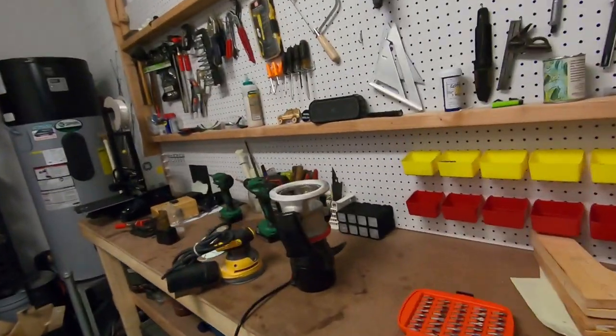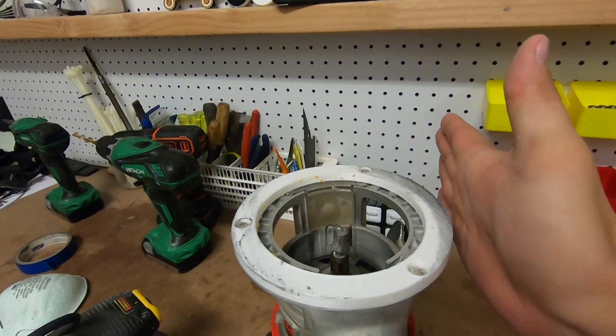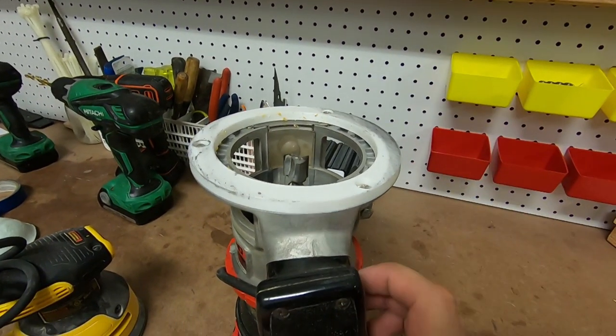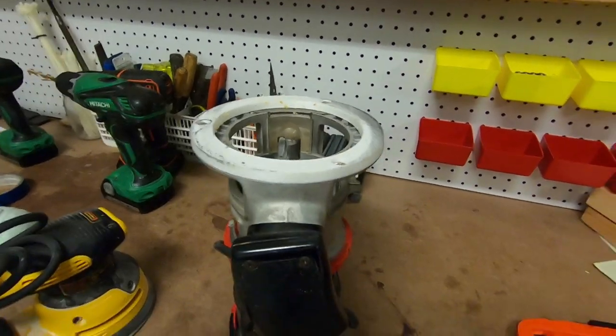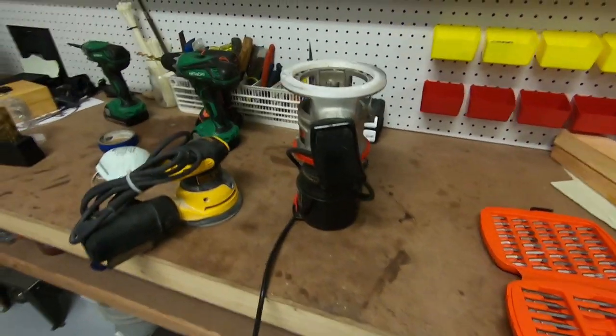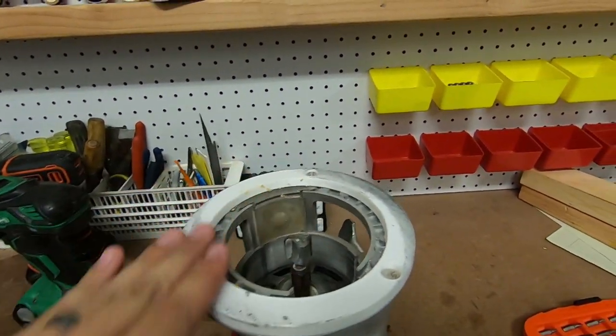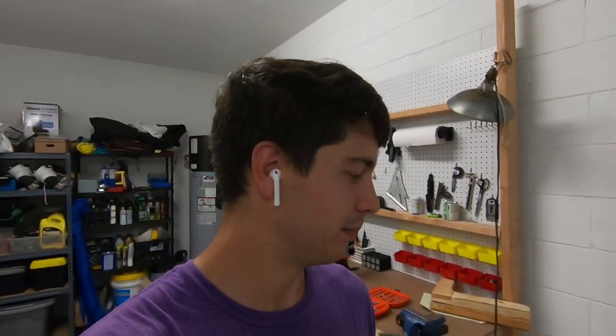So if I use that rail again, I'll build some flat spots into this so it slides straight along the rail and I don't have to hold it in place. That'll help a lot. And then we might make it thicker to account for the wear, and maybe make it out of ABS or some other plastic. We'll see. Something a little more hardy than the PLA. But yeah, very happy with that.